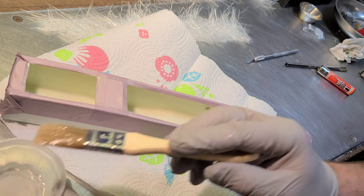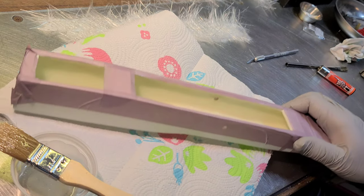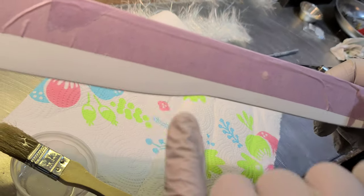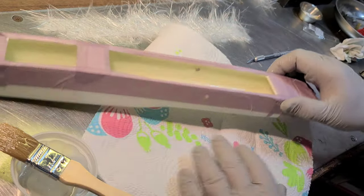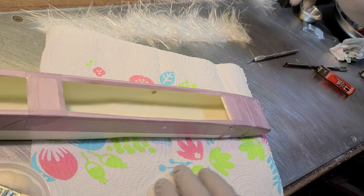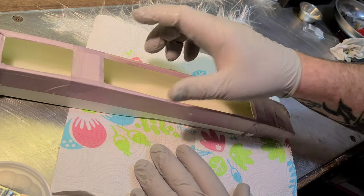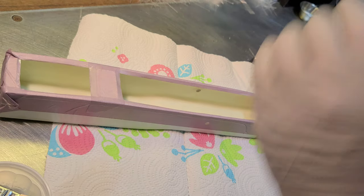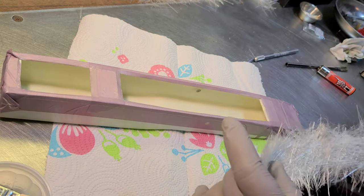Now, you can paint an FRP boat, but you've actually got to sand basically the whole top layer of this plastic coating all the way around this boat to get the best paint job with conventional paints. If you want to use epoxy paints, they will actually stick to this FRP plastic, so you wouldn't have to sand it all down to the bare epoxy.